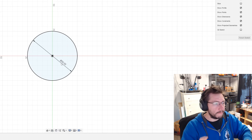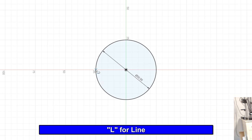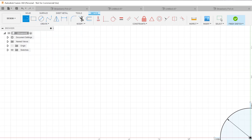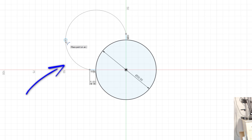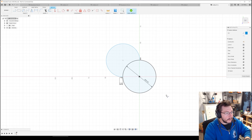Now off this circle I want to create a couple of legs — you'll understand why once we're done. Hit L for line and go out five millimeters on each side, then click the checkmark. Now we're going to create a three-point arc: click here, here, and bring the arc out until the sides touch the 50mm circle. So we've got this three-point arc building a section of a circle right off the center circle. That's it for that sketch — pretty easy.